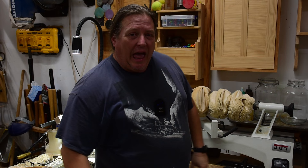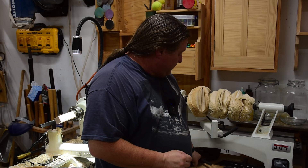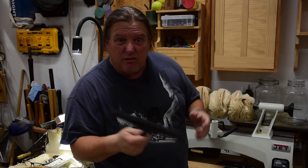If you're as aggressive as me, you'll dent it every single time you turn. Then every time you go to the lathe you're taking a mill file to it and sanding it down. This one came with my Jet and notice it's never been used — it went away right off the get-go to be replaced with something a lot more durable and a lot smoother. Some people do grind different shapes on these iron rests with a grinder to suit their needs, but that sounds kind of pointless to me.